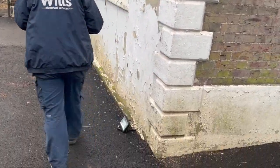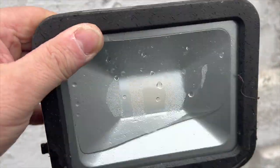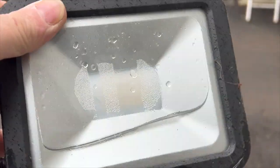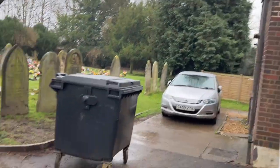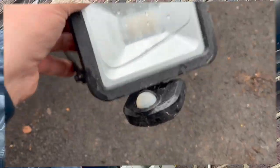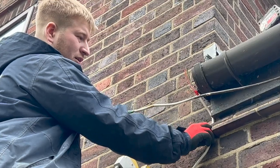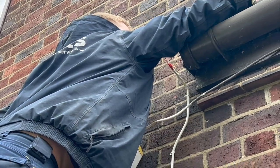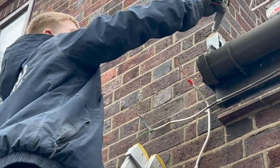It's clipped already, clipped up a bit, so it just snaps on rather than screwing through. Look - this is the problem, it's not the actual cabling, it's the actual light fitting. See that - all three of them are like that. It's pretty odd, quite rare you actually find that, the actual light filling up with water. We've actually got all three of them like that. What we're doing is changing these three security lights because they had water in them. Originally they had this box up here with the cable going into the light.